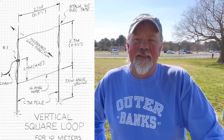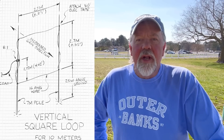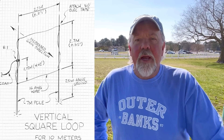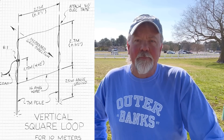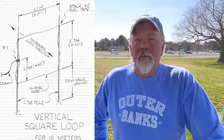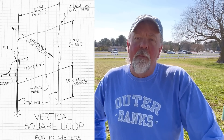I've got a sketch for it here you can check out. What I want to do is put the feed point — which should be about 200 ohms — so about a 4:1 balun halfway up one side, which will make it vertically polarized. I'm going to position this thing to the west of me across the United States, and to the east it's aimed right at South Africa.